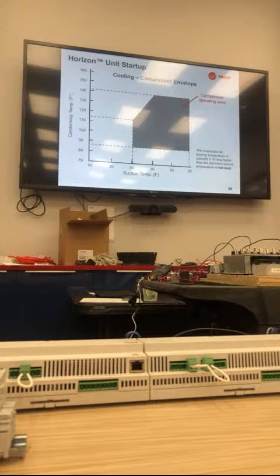I got one on the 80-ton cabinet. We get those liquid line transducers put down in the main electrical cabinet, in that top panel where nothing else is, and it's hard to get to. The liquid line comes through there, and then there's stuff through the bottom of the panel, and then you've got your transducer right there. How come we can't just move it 6 inches down to the lower panel? Are the pressure taps up there too? The service ports. Yeah, I think there is probably a service port up there. Can we just move it all, so we don't have to open another panel? That 80 ton I got is 4 feet off the roof, and then the unit is 8 feet above that to where you get to. It's pretty tough.